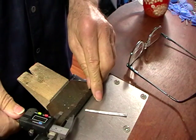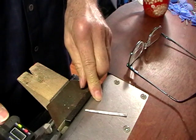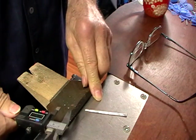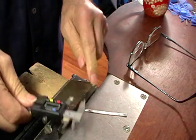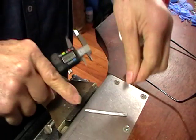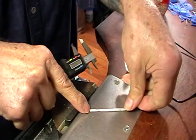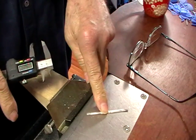So it's like when we did our bangle. That's 8 millimeters, so it's 8.15 from the end. And then every 16.32, and that'll show us where to mark, and that will leave us with an equal amount on either end, so our join will be in the middle of one of these flats.